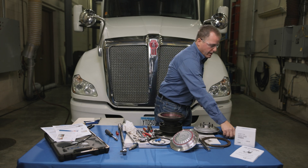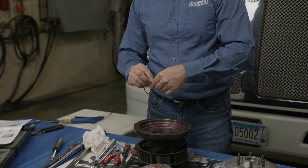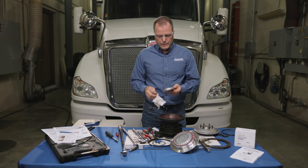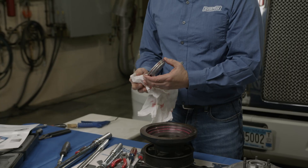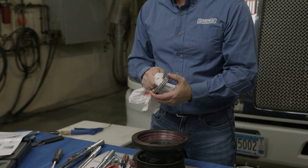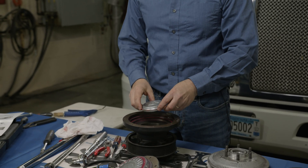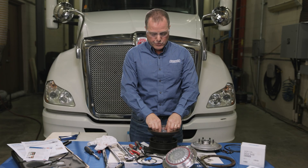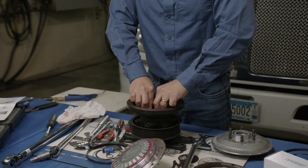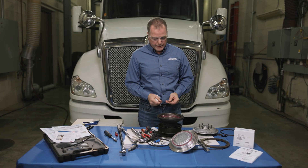Next, take the air cap and install the new O-ring, applying O-ring lube. Before installing the air cap, wipe off the face seal that comes in contact with the air cartridge using a clean part of the rag. Keep the air cap straight and square when putting it in — it should just go right in and you'll hear it click down. Then install the new snap ring from the kit and walk it around, pushing it in with a screwdriver until you hear it snap in.